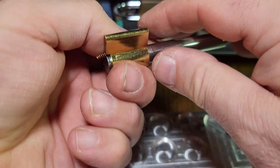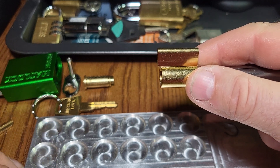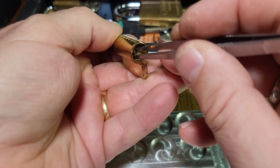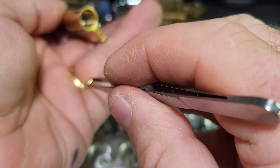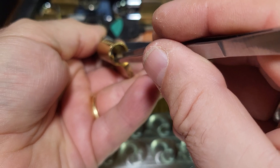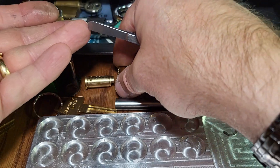Let's deal with this gutting disaster over here - I should have pushed the shim further. The first spring is knackered, so I'll put a new spring in there. Always good to have a load of spares. So pin number two is serrated top and bottom. Three is a spool. Four is a spool. Five is a spool. And six is a spool.